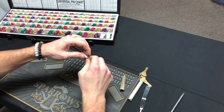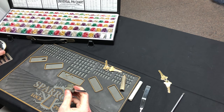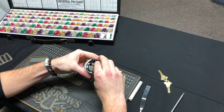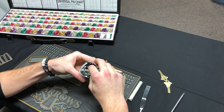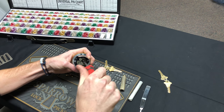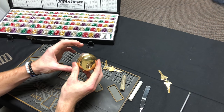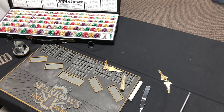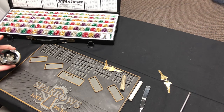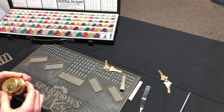Take your key and try it again — turns nicely, pulls out nicely. Here's the old key — no longer works. And here's the new key. Last step is to put the cylinder back inside and put your screw in there — take your screwdriver and tighten it up. And there you go — that is my tutorial on how to rekey a standard Schlage residential deadbolt. I'll be releasing another video showing how to rekey a standard Schlage knob, and also covering automotive ignition. Be sure to subscribe, like, and comment if you have any questions.